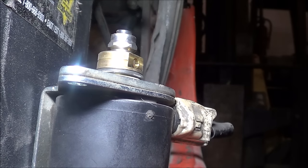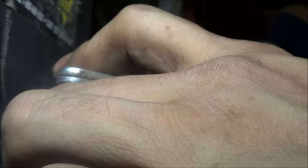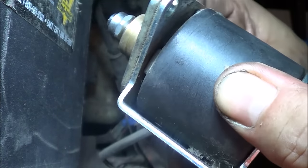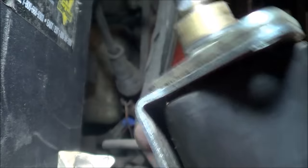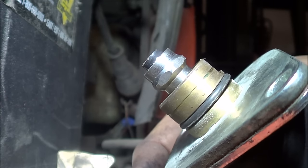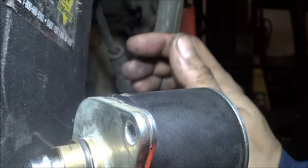My theory on this is that although my coil is not open, without knowing the actual specs I couldn't do an ohm reading on this. I'm suspecting that the coil is weakened and is not able to pull the plunger to open up the passage for the gas from the tank to flow into the primary side. This is confirmation that this solenoid is the problem for the truck.